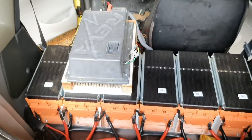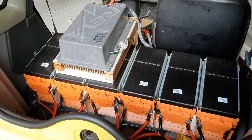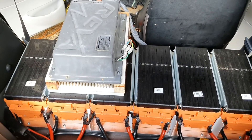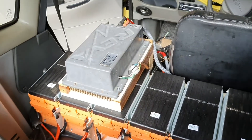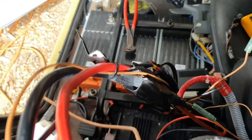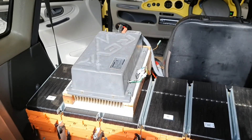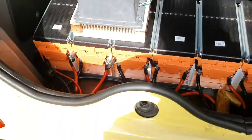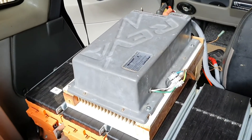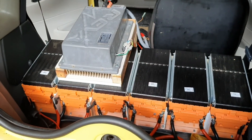That's it for today - I've worked on the charger and got it functioning. I'm just going to charge the car up now and make sure it gets close to 64 or 65 volts. I'm pretty certain it will reach that because it's already gone over 60 volts, which means the little modification device in there is working properly. That's my battery bank wired in parallel and charging off the original charger for the time being, until I get a 120-volt system put in, which is going to be a bit more expensive.